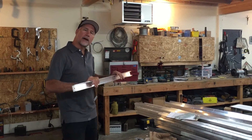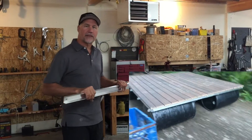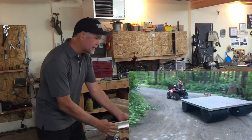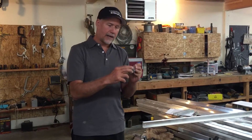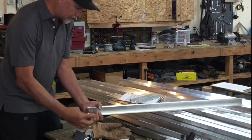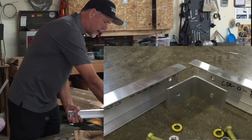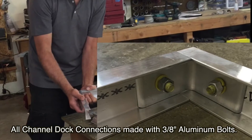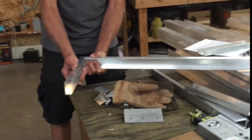It's quite a rugged system — you'll see in some videos where we tow the docks around the yard. These channel docks are bolted together at the ends with an angle that is three-sixteenths thick, two-inch angle, which bolts into the edges here. I can grab a small piece of channel to show how that works — and voila, that's how we make the connections. It makes for a very strong, very secure, very square connection, and the bolts line everything up nicely.